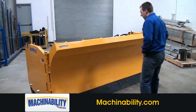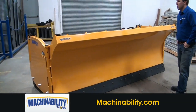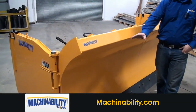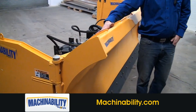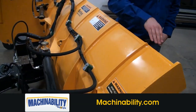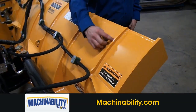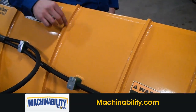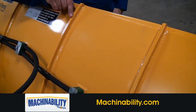All our plows are fully welded and are a double-skin construction. As you can maybe see here, we've got our main moldboard and a second plate, which is like bridge construction. They're fully welded on the inside moldboard and then fully welded again on the outside, the rib going right through from the front to the back.